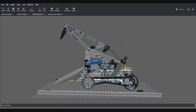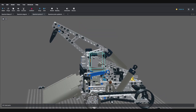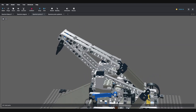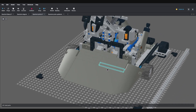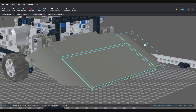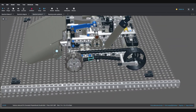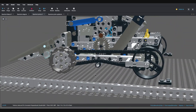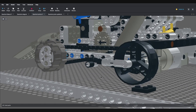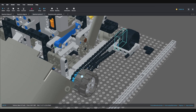And eventually this is what I came up with. I've got these main big black frame pieces — the force of the crusher is going to go straight through the middle of this assembly, so I had to design all of the gears and pumps to go through that middle section. Here's the finished design of the prototype for Quantum. I've managed to squeeze all of that mechanism inside the frame, with the first prototype head design there to attach all of the teeth. I've also worked out the wedge at the front, and with two different wheel sizes front to back, I needed different-sized sprockets on the chain — it just so happens that LEGO recently released 20-tooth gears without the bumps, which work nicely with the 24-tooth ones on the back.